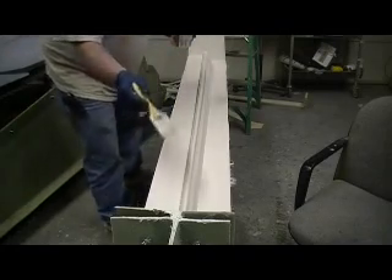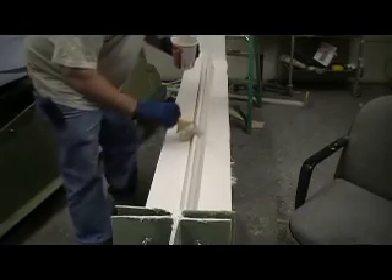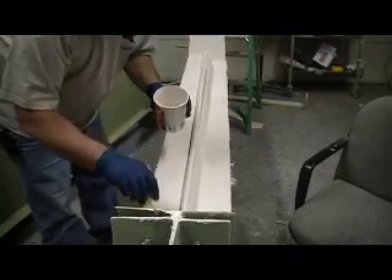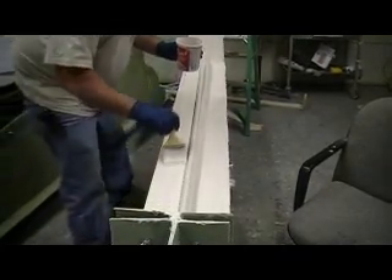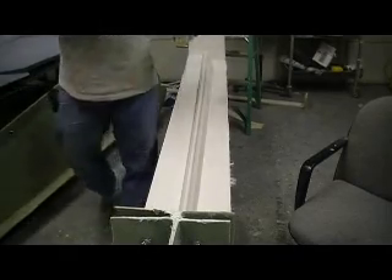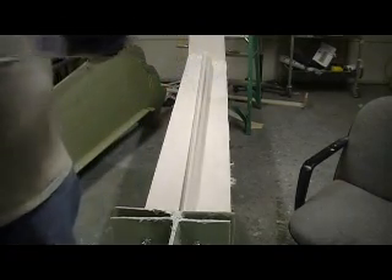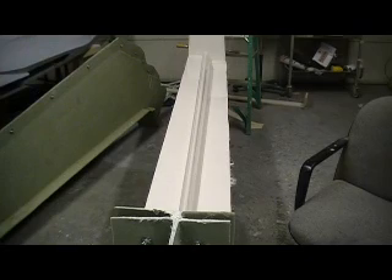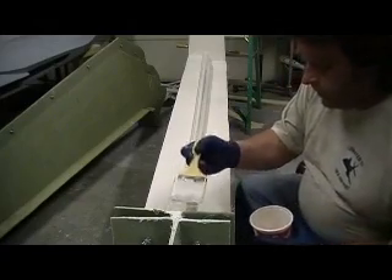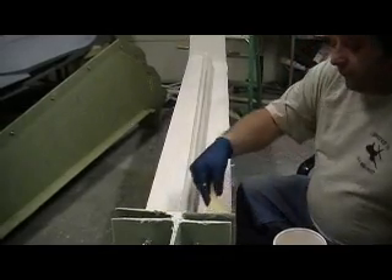And if I had some vertical surfaces — corners — I would probably still thicken some up with calcium carbonate just to keep it from sagging. I kind of just play things by ear, depending on how long I've got. If I've got time to put two or three coats on it, I'd probably just go with thin coats. But if I was getting started on something later in the day, I might thicken some up for the corners. One thing about my shop is I don't have to do things any certain way.